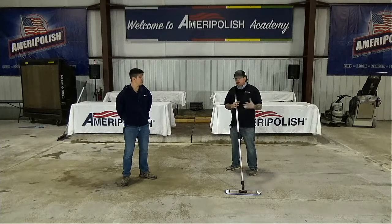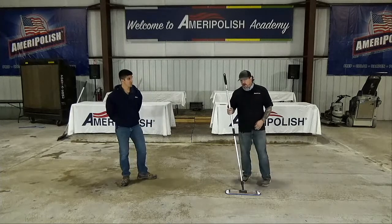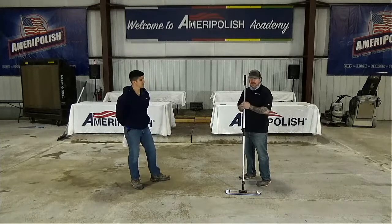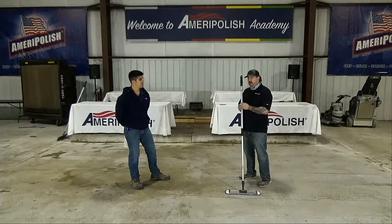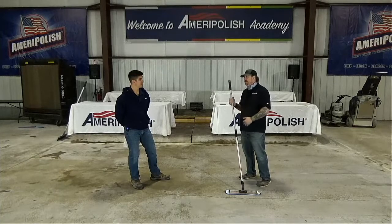Like we say, you'll notice it right away when you start spraying it, and if it dissipates, add more to the area. Now if it's taking too much, you can spray it down, then come back, wait an hour, and spray another coat. Or what I like to do is spray it down, wait an hour, hit it with the next grit, and then apply it again. Now hold the densifier close to the surface.